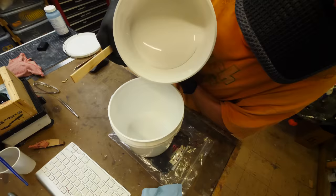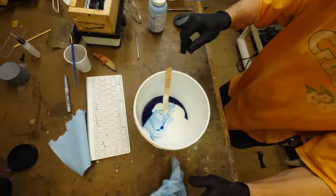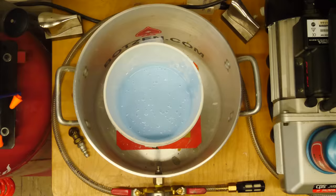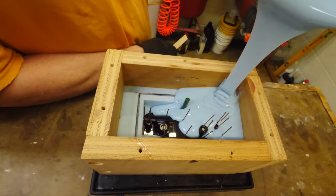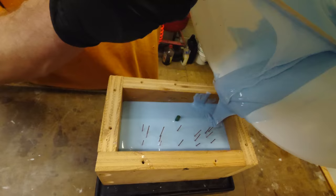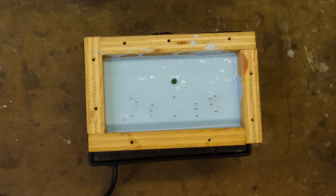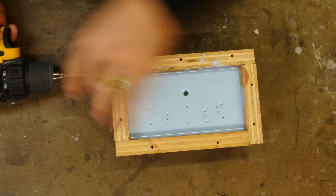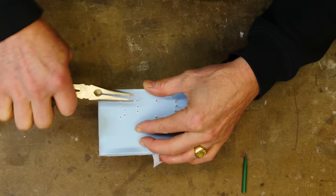It's time for more math so you can calculate the volume and the amount of silicone needed. Add the appropriate amount of catalyst, mix thoroughly, and place in your vacuum tank to degas. Again we're going to use the vibration table and pour our silicone. When I pour the silicone I pour it in one spot — this allows the silicone to flow out without trapping air bubbles between the part and the silicone. Bubbles are your enemy when pouring silicone. Let's take the finished mold out of the mold box — it's time to reveal your two-part silicone mold.